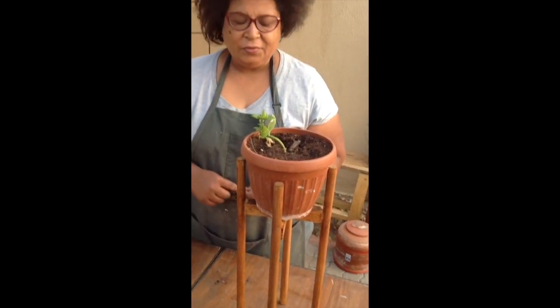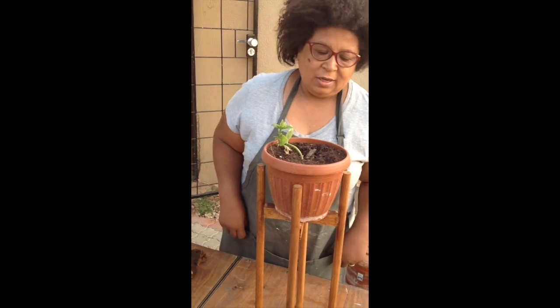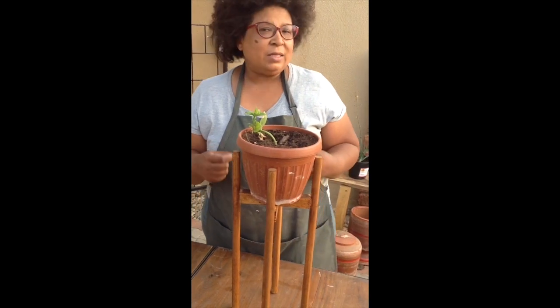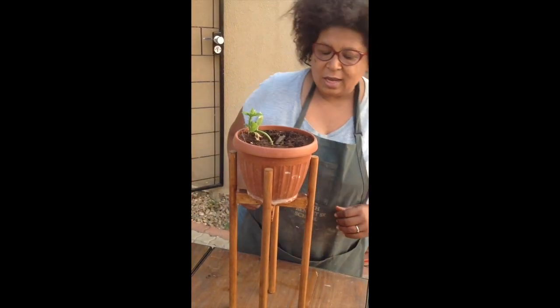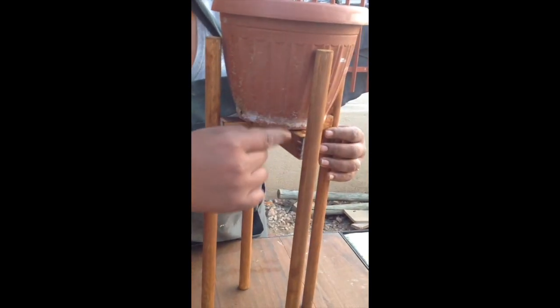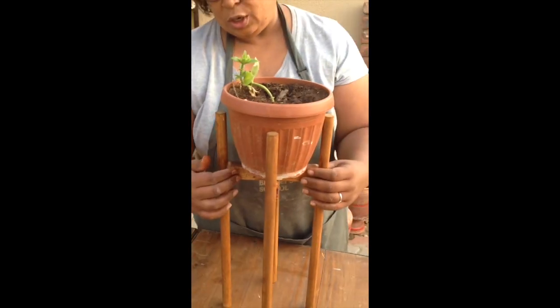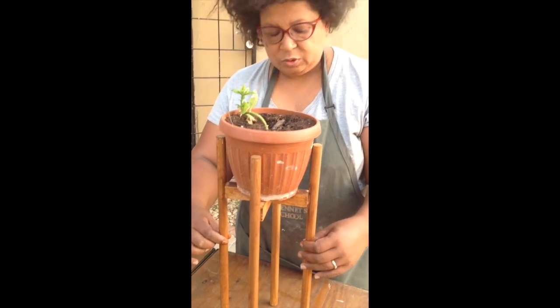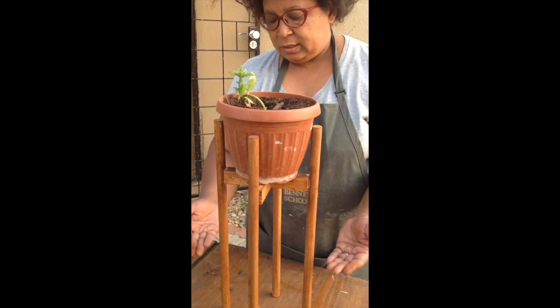I want to talk before we leave a little bit about things that we could have done. And always when you're finished with a product towards the end, you think about, oh, I could have done this better, I could have done that better. And in this case, what I would have liked to have done is to put a little rounding on the edge so that the dowel would sit nicely into a little curvature on the ends. The second thing I would have done is to lower the cross that it supports to give it more stability at the end, or just to make this a little bit shorter. The Namibian sun is drawing down, beautiful Namibian sunset.